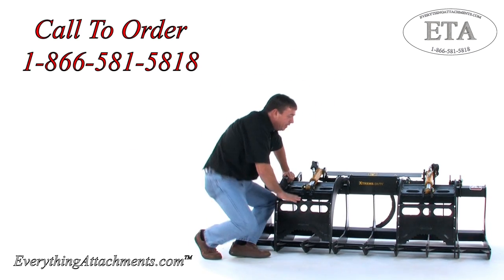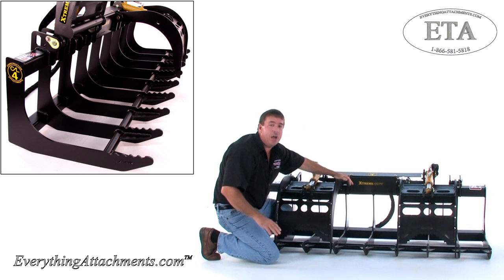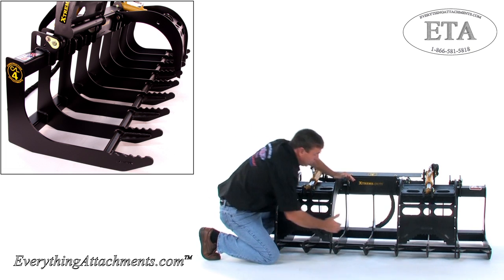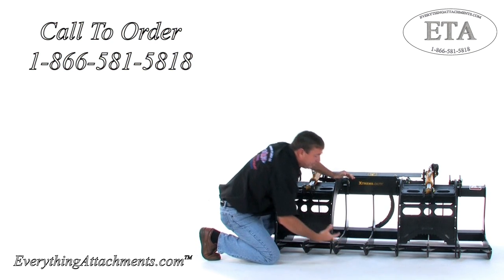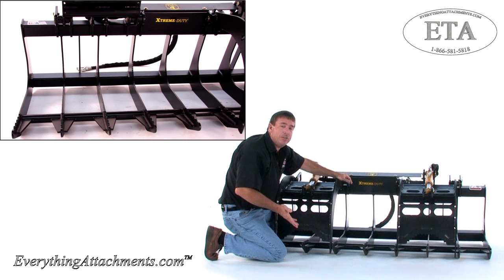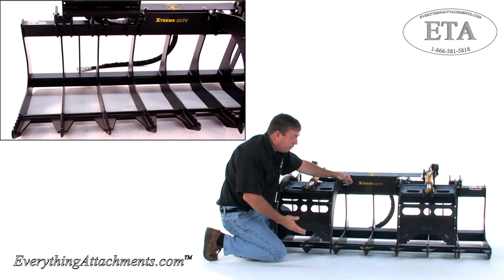On the front of the gussets, this round bar here — a lot of buckets use a flat bar, and the problem with a flat bar is when you angle these teeth down under the ground to get all the roots, you've basically got a compact tractor with only so much push to give. You want this round bar to act like a wheel, to regulate how much pitch you're putting onto those teeth and keep you from going too deep. We try to put as few gussets up here at the front as we can so you can get good penetration into the ground. The more gusseting you find within a grapple actually means it's cheaper built — it might weigh more, but it won't be as strong.